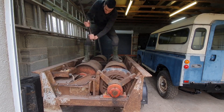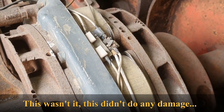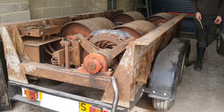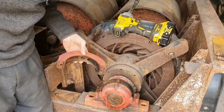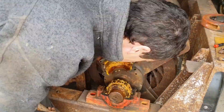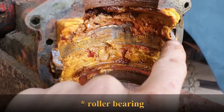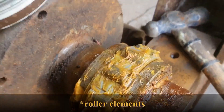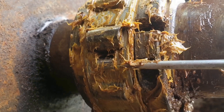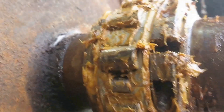I set out to free the brake and obviously this wasn't going to work — it very quickly descended into dismantling the brake. First the torque measuring assembly comes off. I'm just going to strip this thing in an order I can manage. Basically it's a split ball bearing: there's a bearing outer race split into two shells, a bit like an engine main bearing, and all the ball racers are here. There's a slit — the cage is in two halves — so it seems like this thing was assembled on the shaft.